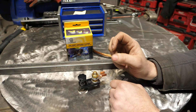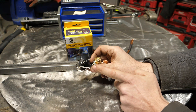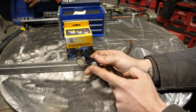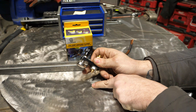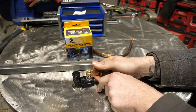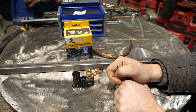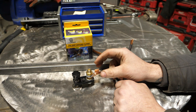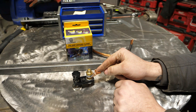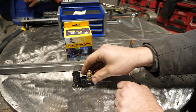In the previous video I did on this, I discussed these magnetic ground clamps. Essentially, you put your ground clamp wire onto here and this makes contact with the surface via a very strong magnet — it helps that this table is over an inch thick. This is only rated to maybe 150-200 amps, so it's okay for something on a smaller welder, but I'd want something more beefy on a more powerful welder.